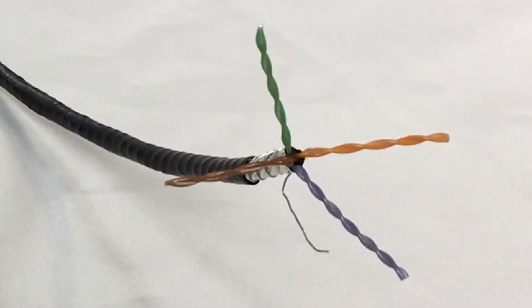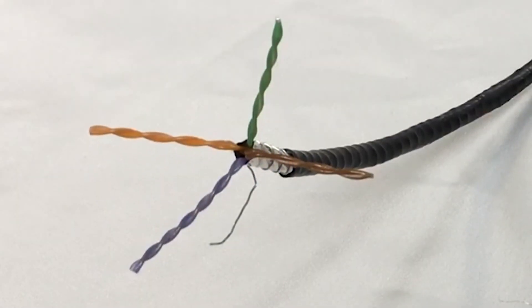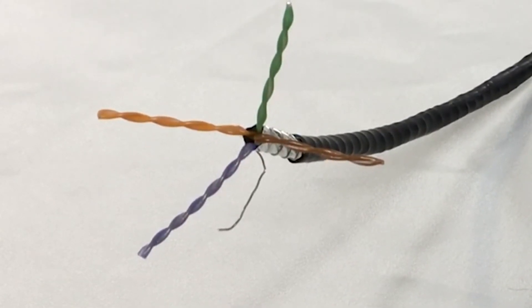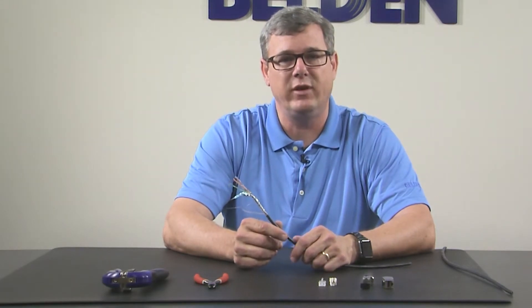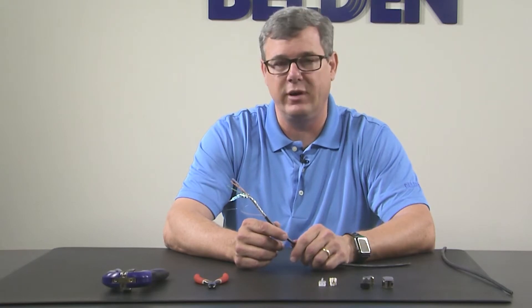The unique things you'll notice about this cable is that while it is an overall shield, it has a unique drain wire in that it's helically wrapped around the product. In addition, we have 23 gauge pairs. These pairs are bonded together with Belden's patented bonded pair technology within the cable. This, together with the shielding, basically gives us an HDBaseT cable capable of sending a 4K signal at a 100 meter distance in a bundled configuration.